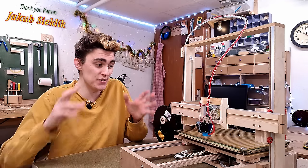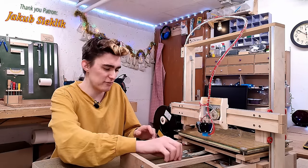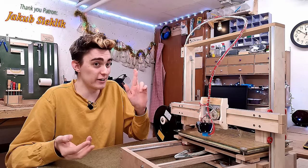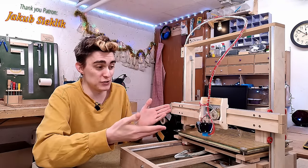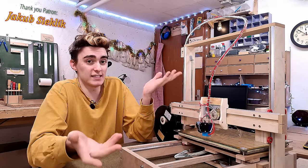This is not to say you can't build a decent cable-driven 3D printer. I'm sure a well-made cable drive would work just as well as any belt, but it's not as easy as doing something and crossing your fingers for it to work. And since doing it properly in this case would be much more elaborate than installing lead screws, I'm quite happy to see the cable drive and the gear reductions go for the added simplicity.